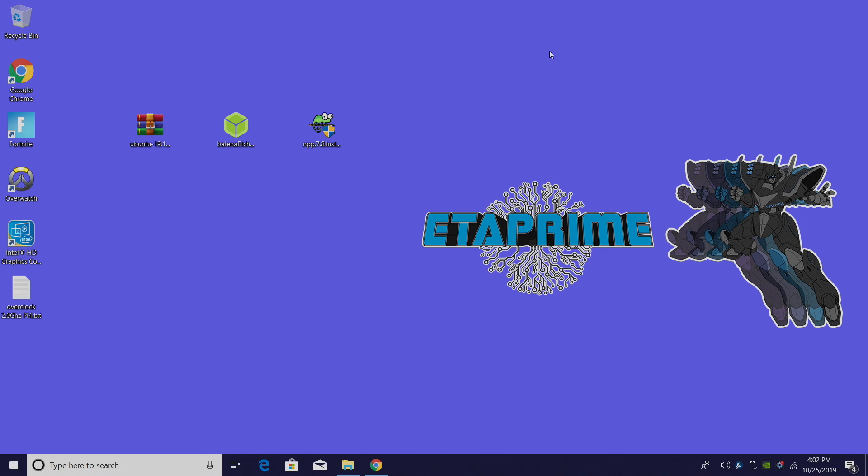We're now ready to move over to the Raspberry Pi 4. I'm going to plug my SD card in, HDMI, keyboard, and Ethernet. Ethernet is important for this initial setup because the desktop is around 3 gigs and we need to download it all on the Raspberry Pi — that way we don't have to do any extra setup. We just plug the Ethernet in, type in what we need, and it'll start to download and install everything for us. So let's go ahead and move over to the Raspberry Pi 4.